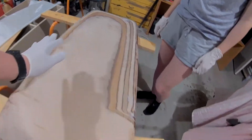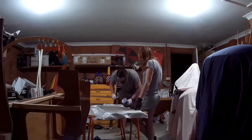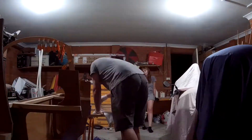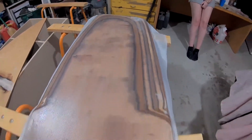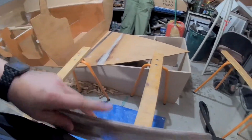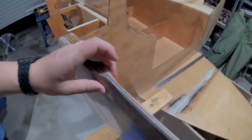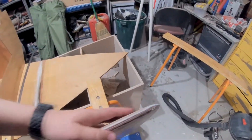Now we're going to do this virgin side. It's all done on this side now — hopefully good enough. Double layers of epoxy and fiberglass on both sides of the center board. You can only go up to the edge, so the edge is unprotected. I thought what I might do is put some fiberglass over the edge so there's a nice overlap.